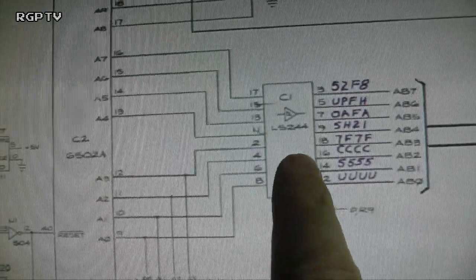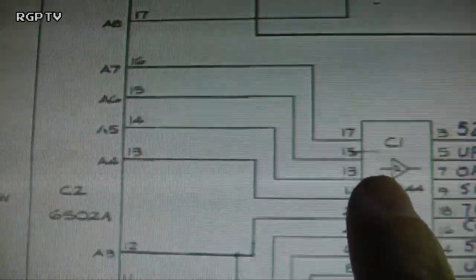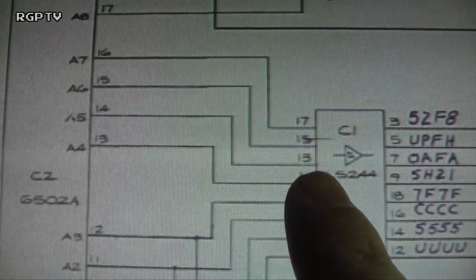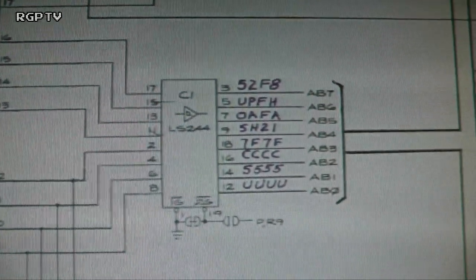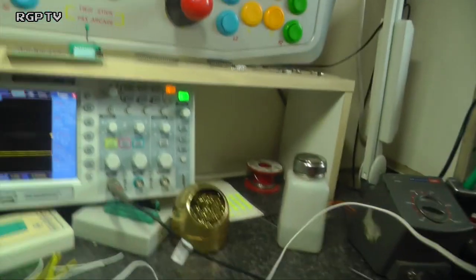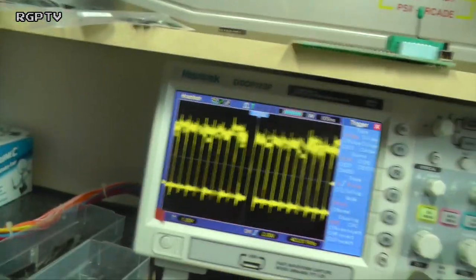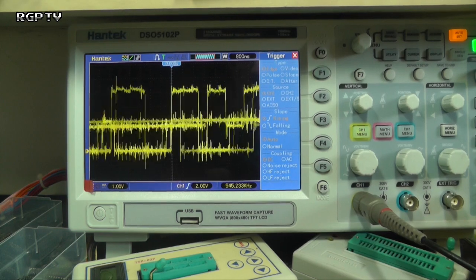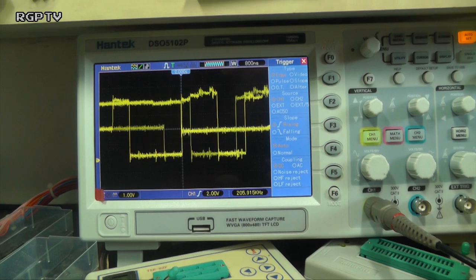Right, okay, these go down through this 244. Let's have a look here. So what have we got? That goes in 15 and 13. So it's saying the tie is at the chip. Is there something wrong with that chip? So to another ROM, ROM UUT. Right. Let me just try something. Sometimes works. There's your 13, 14, 15. So it's saying 5 and 6 tied.